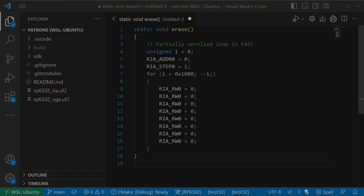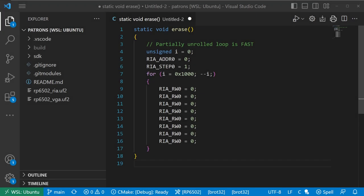We'll never sustain that, but we definitely need to handle bursts in case of unrolled loops. For example, a loop to clear the screen runs several times faster if we unroll it to burst out 8 bytes at a time. That's just the data though — we need to associate each byte with an address, so let's send a full 16-bit address with every 8-bit data value. What was an 8-bit problem is now 24 bits. If we use the 6502 clock we can do a parallel bus of six wires — six bits times four clock cycles is the 24 bits we need — but we still need framing and addressing multiple video cards, so we really need a seventh wire. Except I don't have seven GPIO pins. I don't even have six. I have four.